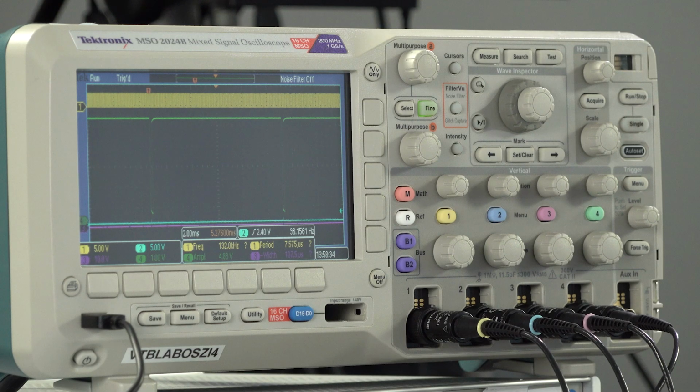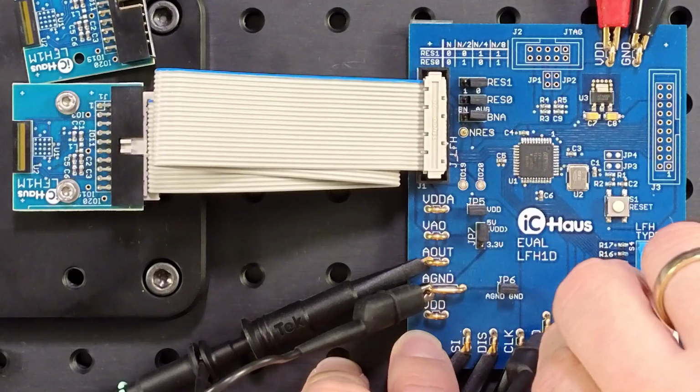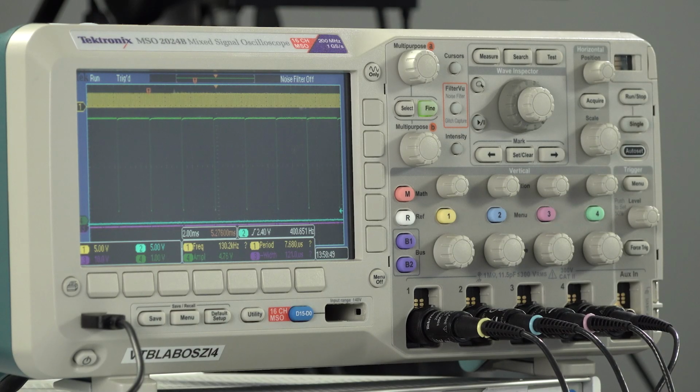Let's change the frequency of the pixel clock with the rotary switch S2. As the shutter is permanently open, currently light is collected the whole time between 2 start integration signals. When the clock frequency is increased, the time frame between 2 integration signals becomes shorter, so less light should be collected. Position 0 is the slowest, 100 kHz, so I'll dial it up to see when it goes out of saturation.